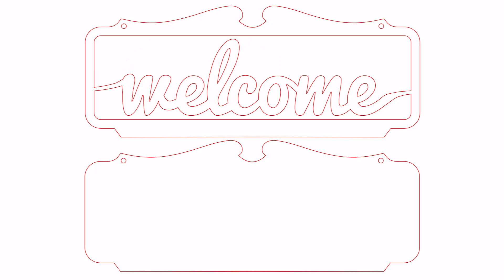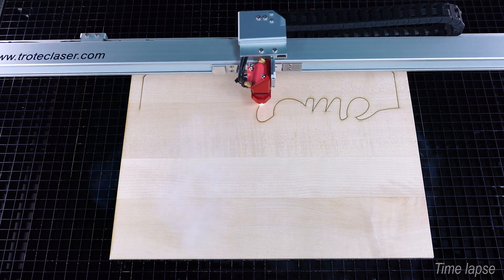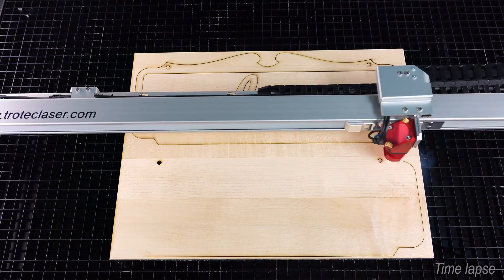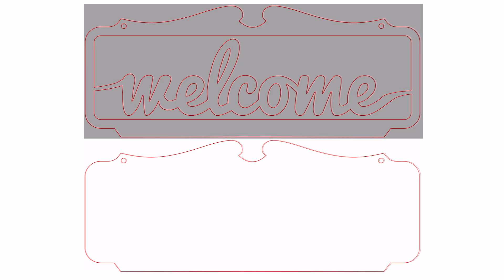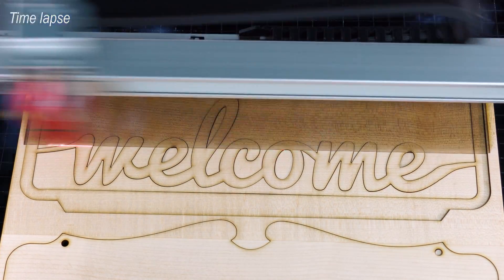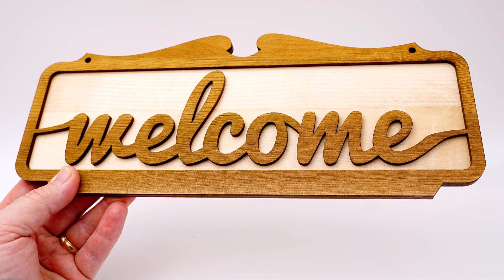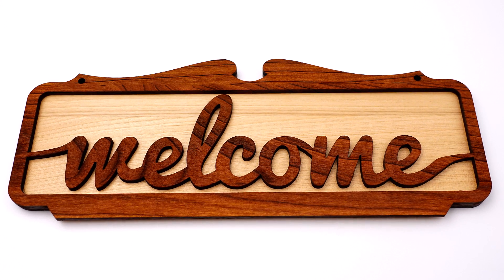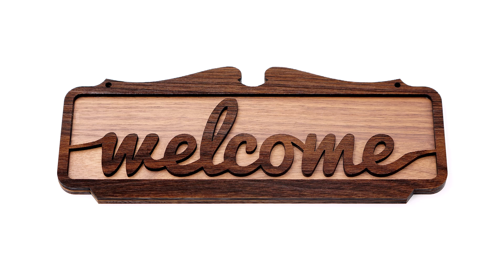Here's another example design, as signage is an ideal application for this process. Taking this welcome outline sign and laser processing it onto maple wood instead of cherry wood. Like before, first cut it with the laser, then send the black engraving file and engrave it last. After completion, the engraving is again sprayed with a clear coating and glued to the base. The maple produces a brownish gold looking effect. As a comparison of wood species, I have also processed this same design onto cherry wood, and finally here is walnut wood.